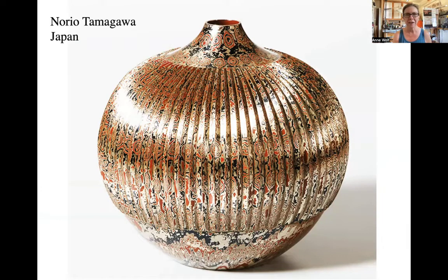And there is a video that he made, I think called Tenkin, which is like a hammering, that shows how he makes these vessels. And I can tell you, for those that know a little about the technique and are curious, he doesn't just pattern the discs and then raise a patterned disc. He does a lot of patterning as he's raising. So he'll pattern a little bit, then he'll raise a little bit, and then he'll chisel to create pattern, and then he'll planish it back smooth, even though it's already a bowl-shaped or vessel-shaped object, and continue on, so that the raising and the patterning happen together.